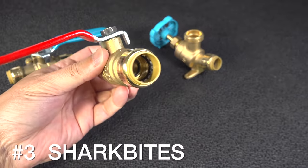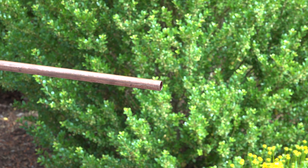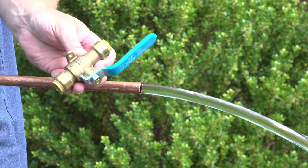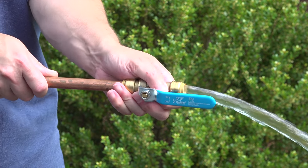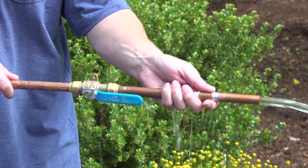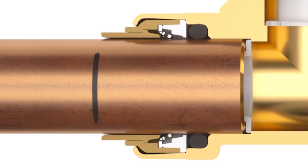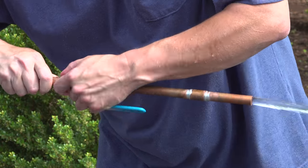That's to use SharkBites. If you've never heard of SharkBites, these are an instant plumbing solution that lets you connect two pipes together without any special tools. Start by deburring the end of the copper pipe using SharkBite's really cheap deburring tool. Because you're not using a torch, it doesn't matter if there's water in the pipe — it can be dripping or even full flow. You just slide the SharkBite onto the pipe and the connection is done. SharkBites use O-rings inside to make the watertight connection, but you don't need any tool to compress it — the SharkBite ring holds the pipe, and once inserted you cannot pull it out without a special release tool.